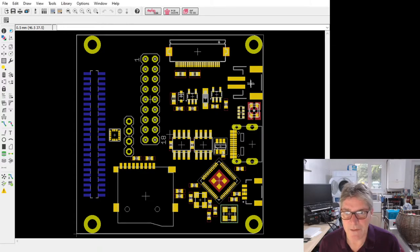So this board will be able to house the camera, Wi-Fi, time of flight sensors or distance sensors, if you like, plus a gyro or IMU type device, all on one board. And you can't put that on a normal tile, you can only put that on something like a super tile because you need more IOs. I mean, the camera alone uses 12 IOs. So would that be suitable for your robo tank, Laurie? Does that tick all the boxes that you need?